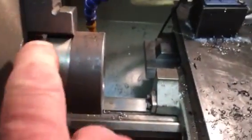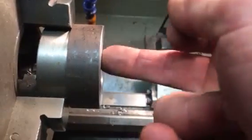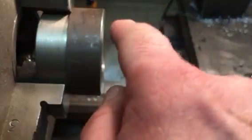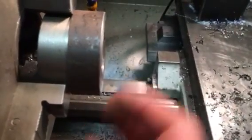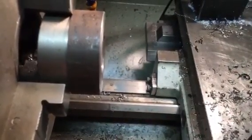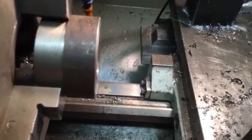One thing to point out: with the piece in the chuck here, it's very advisable to machine down a step so that when you're putting pressure from the tailstock against this face, the jaws are coming up against a positive stop. Otherwise, if it were all one diameter, the force can actually push the workpiece back up into the chuck — meaning the job becomes loose and falls out between the pressure pads. Not a great result.